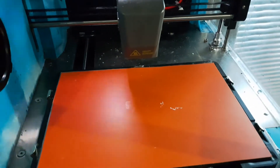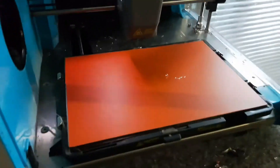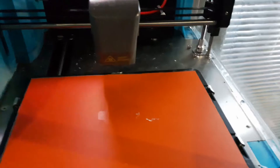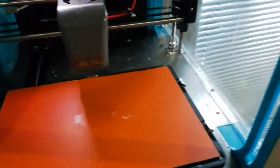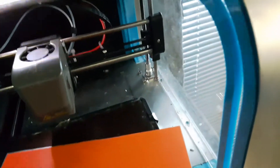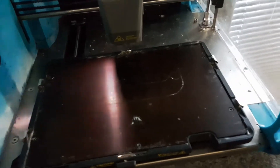The only last thing is how to bond the PEI sheet to the steel. There are a couple of options. One, you don't have to use the Revobox PEI sheet — you could put lock-build straight onto the steel, which works quite well. Alternatively, you could use 3M PEI adhesive sheets. My Revobox PEI sheet was getting tired so this one actually has a 3M PEI sheet stuck to the steel sheet.